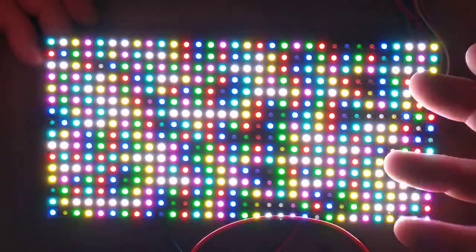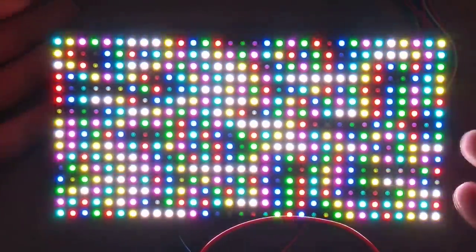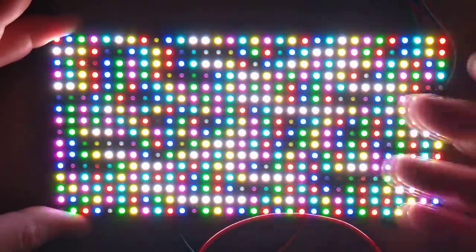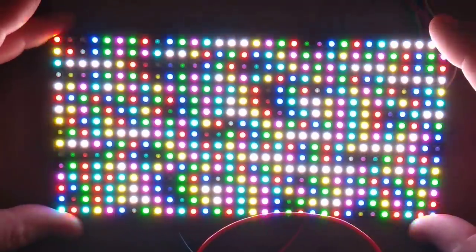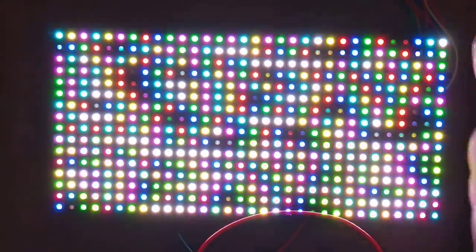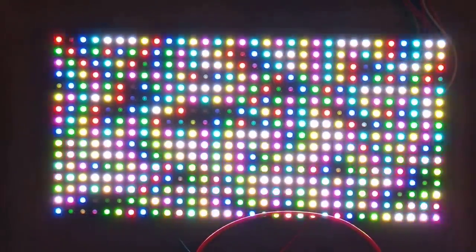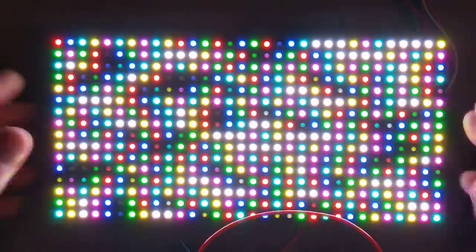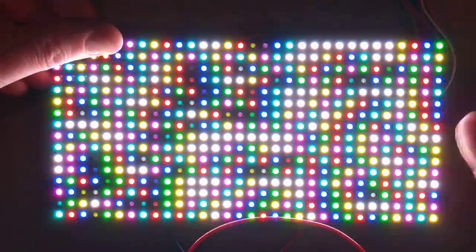You can see a very slight shimmer - it really eats processing cycles when you have to generate the image not just in real time but while multiplexing simultaneously. I shift in the linear feedback shift register, reseed it to start again. When it goes to the next frame it repeats that several times, then increments the shift register and restores the seed so it's one step further across. It can go really fast - at speed 7 it was just blurring across the camera.